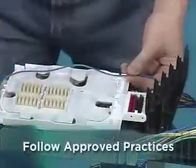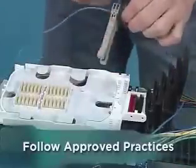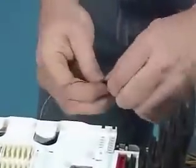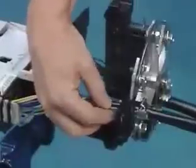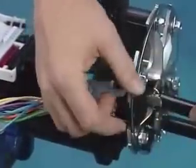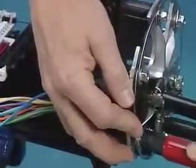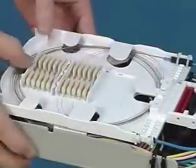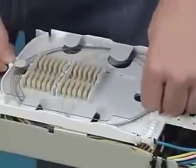To splice: route, mark, ring cut, and remove the excess buffer tube, and clean the fibers per your approved practices. Add loose buffer tube wrap. Route and tie down the designated tube to the tray. Attach the branch or drop cable to be spliced to the star bracket using the same procedures as the main cable. Route, splice, and store fibers on tray and install tray cover.